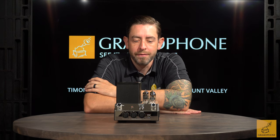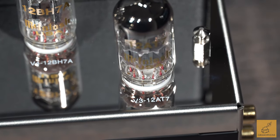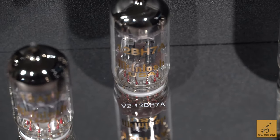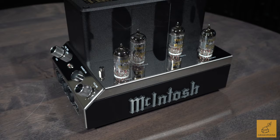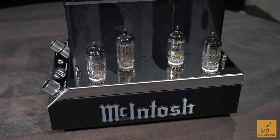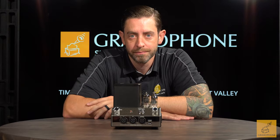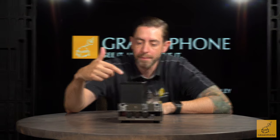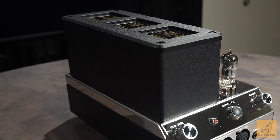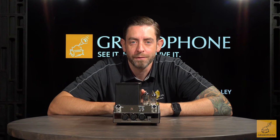Taking a closer look at this headphone amplifier, as you can see it has two 12AT7s and two 12BH7As — very powerful and compact vacuum tubes. The 12AT7s amplify incoming audio signals while the 12BH7As provide power to drive your headphones with low distortion. You get two output transformers and a power transformer; these are unity coupled circuit output transformers that deliver pristine audio performance.